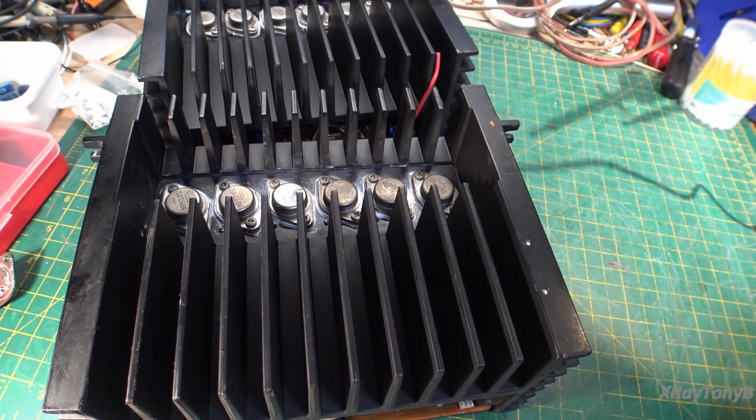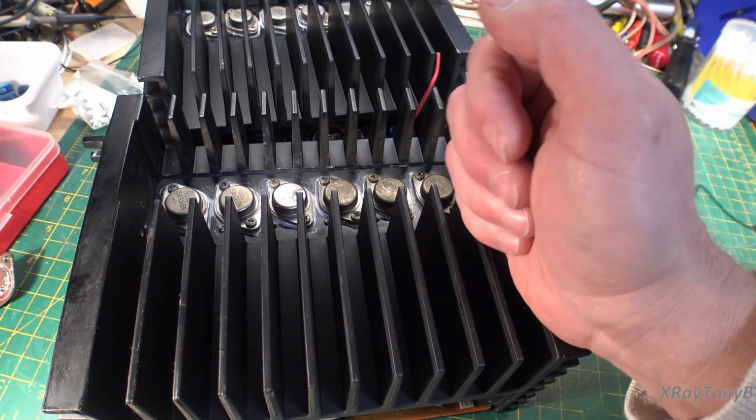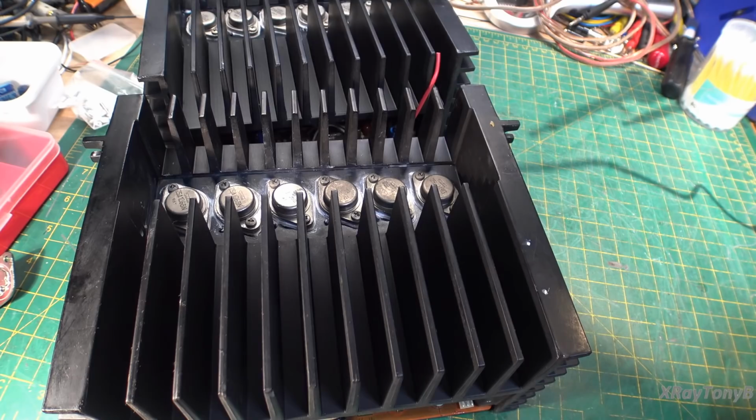This video, we're going to talk a little bit about the AU-X1. The first thing you need to understand was what was the purpose of designing the amp the way they did. And the reason is a new buzzword that came up at the time called TIM distortion, T-I-M. And that's an acronym for Transient Intermodulation Distortion. So what is Transient Intermodulation Distortion?